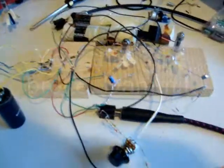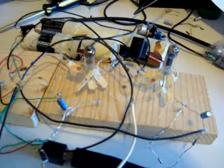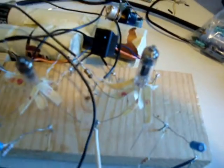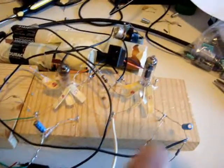This is the circuit that I put together mostly today. Out of two tubes, it's a two-stage preamp and most of the time it sounds pretty clean. You can get a tiny bit of distortion out of it. I've got a rudimentary gain control wired up in between them and then a master volume control to the output. And that's really all there is to this circuit.